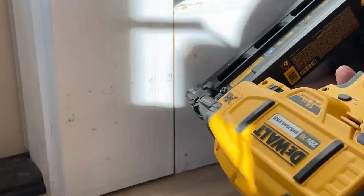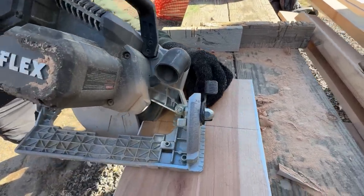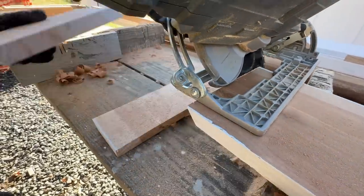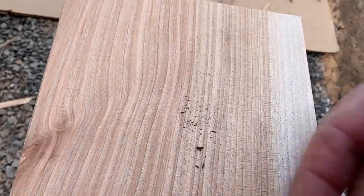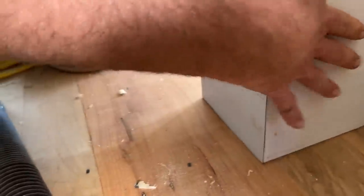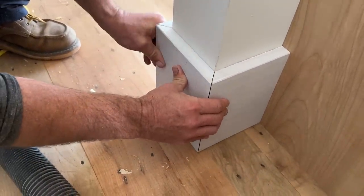The frost just had me totally enamored. We're cutting these baseboards this morning with Larry, which is not the ideal tool really — I think a chop saw might be better. A lot of these are measured to the 32nd of an inch by Jason. This is not ideal but we're making it work. This is going to get caulked and painted, so I wouldn't do this on stain trim. But it's working. Here's a little trick I learned from Arlo: if you make an errant mark, you don't have an eraser — check this out. I think that's for a circular saw. The wall is just not quite right. That's perfect — a little caulk in there.